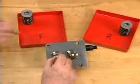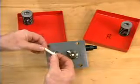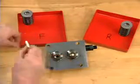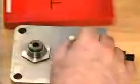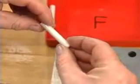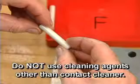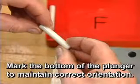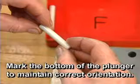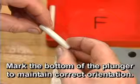If the plungers are fully upward in their bore, light air pressure at the inlet fitting may be used to aid in plunger removal. Remove the plungers one at a time and inspect for damage. Scoring or scratches that can be felt are reason to replace the pump head. If the plungers are acceptable for reuse, they should be cleaned with contact cleaner. The plungers must be returned to their original barrel in the original orientation. If necessary, mark the bottom of the plunger with a felt tip marker to aid in maintaining correct orientation.